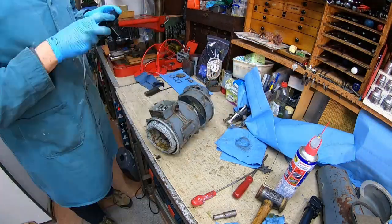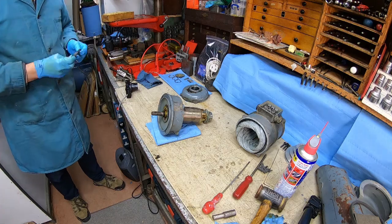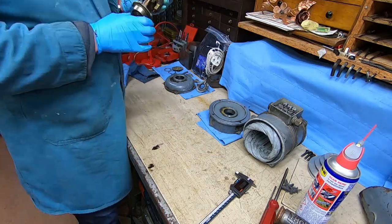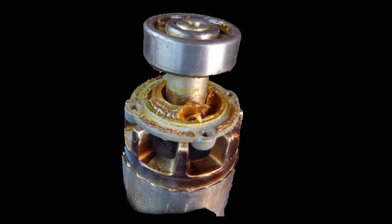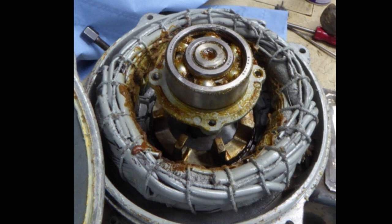Now the rotor and front cover can be pulled out of the body of the motor. The bearing cover at the front is also held by two long 2BA screws — I remove the screws and the front bearing cover. I heat the front cover with a hot air gun and it pulls off the bearing easily using just my hands. The rotor is free. The inner races of the two bearings are still tight on the rotor shaft, but there's plenty of room to wash them out, so I'll leave them. Now, do you remember those long 2BA screws? Well, between the bearing and the rotor is an inner bearing cover — that's what the 2BA screws screw into. The question is: how are we going to hold those inner covers in the correct position when they're inside the motor and we can't touch them? There is an easy answer, and I'll show you during reassembly.